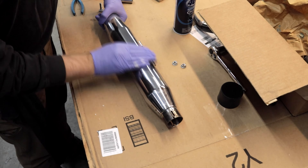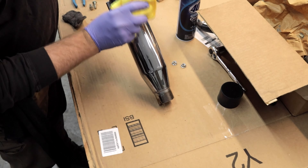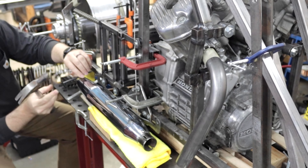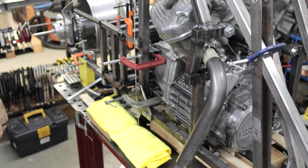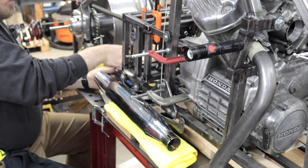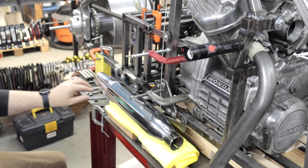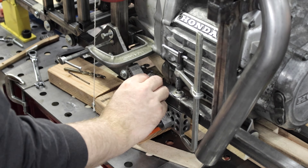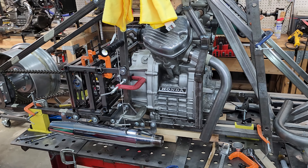These were chromed mufflers that had been around for a while and had some corrosion on them. A good tip I found online was to use oven cleaner and fine steel wool — it worked great; they look almost as good as the original surface finish. With brackets made and fit test looking good, I drilled the holes to mount the mufflers to the frame. I marked the position, clamped a drill guide to make sure the holes are straight through the frame tube, bolted the bracket on — looks good — and added the front bolt as well. It's surprising the force required; you can see my whole thousand-pound frame jig table move. I came out pretty good and I'm really liking the look.